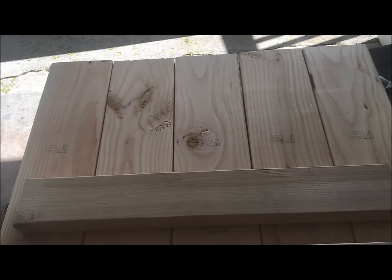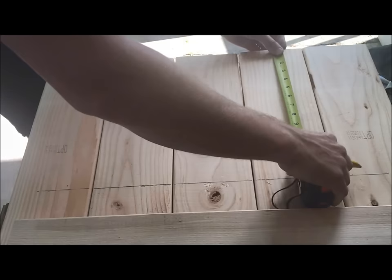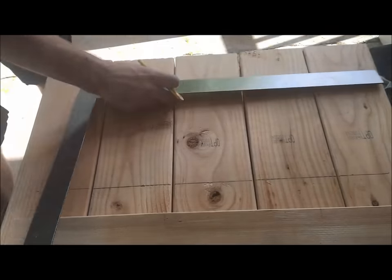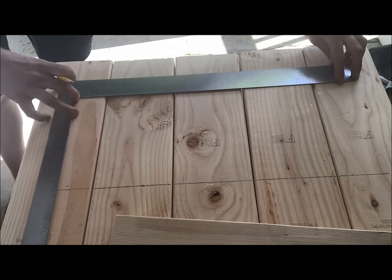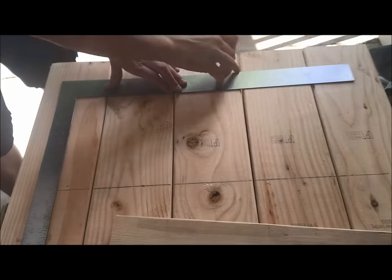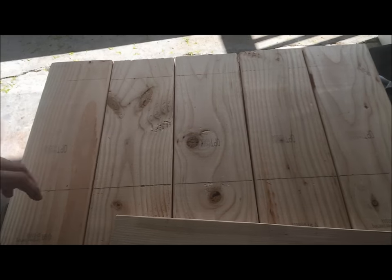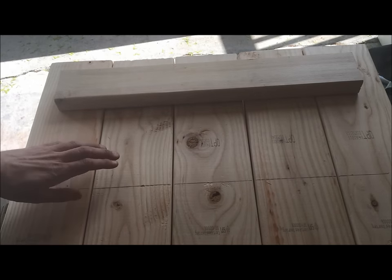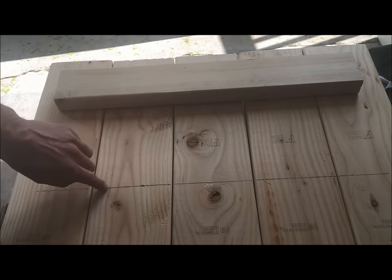So what you do, grab your tape measure, make a mark at 2.5 inches. Grab your straight edge. And that will be board number 1. And then board number 2, I have this line at 13.5 inches from the face of the table. So come back 13.5 inches, draw your mark,